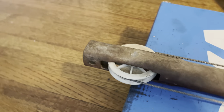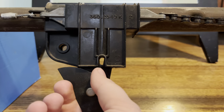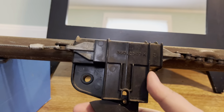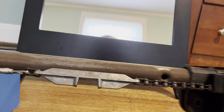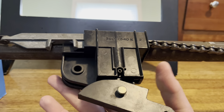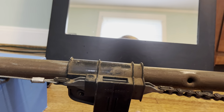Like I said, half chain, half cable — it's got a five-piece tube rail. Down here you have the pulley right there, and then here is the trolley system. You can pull this down and back and it will stay disconnected as long as this little thing is hooked. You can also push it down and forward and it will stay disconnected. There's the inner slide right there — the flat side is facing up. To connect it, you have to push it back so that this little thing is in that slot, and then when you bring it over it will connect. It's a little stiff.